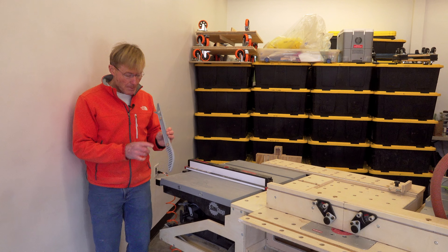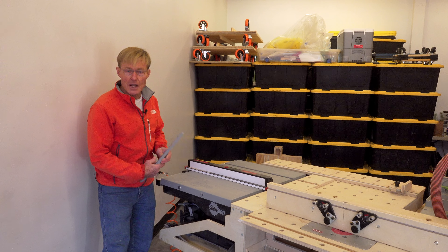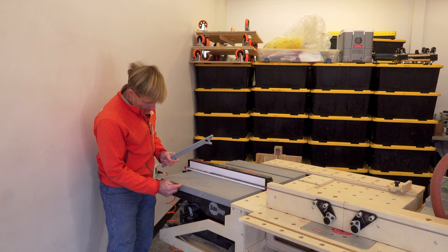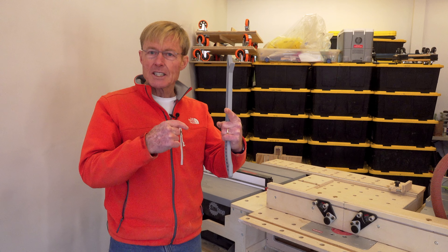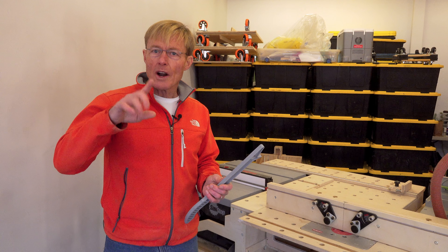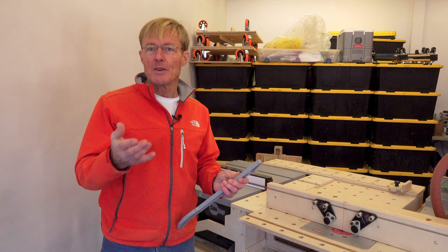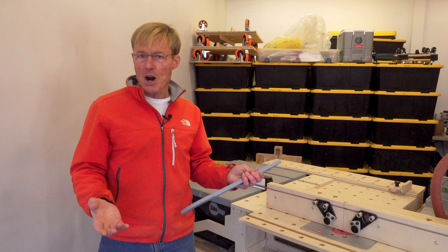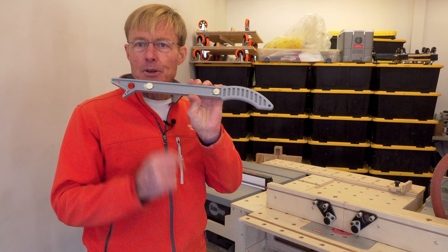All I did was pick up a couple of magnets — I got these from FastCap — and I took a couple of big washers. I figured out right where to put them and made a couple of marks on the side of my table saw. Then I got a two-part epoxy. I buy those little syringes and I always keep a couple of them around. I had to go to the store and find one that worked with metal. I found one that was good for metal, wood, and ceramic — a good general purpose five-minute epoxy. I epoxied on the magnets and let them cure up.